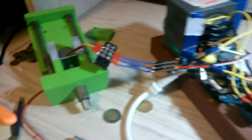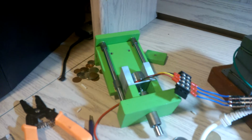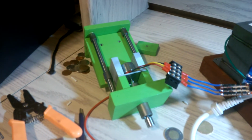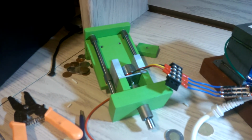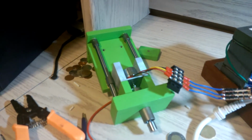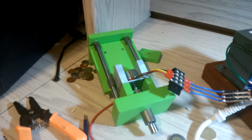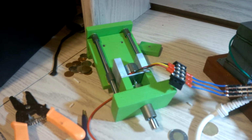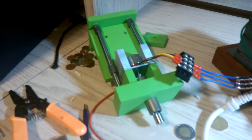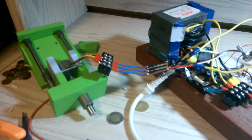But overall I'm pretty impressed. I'm pretty pleased with it. I think I might have to do another cutting gantry with a belt drive. I hear that's a little bit nicer. You can run the motors at lower RPM, find more easy to find motors, and then use a belt to change the RPM for the spindle, and you get hopefully some vibration damping.